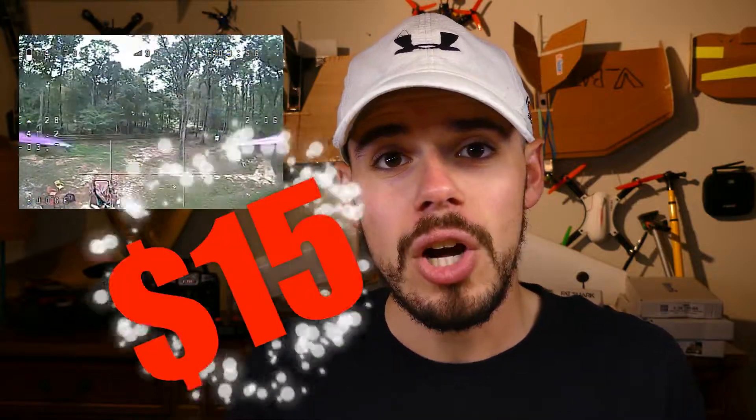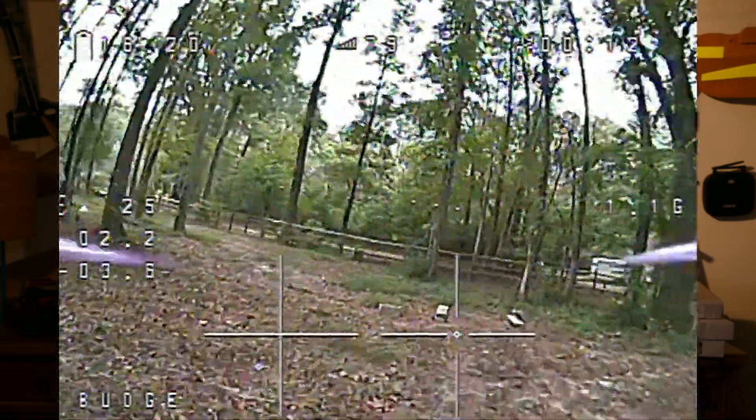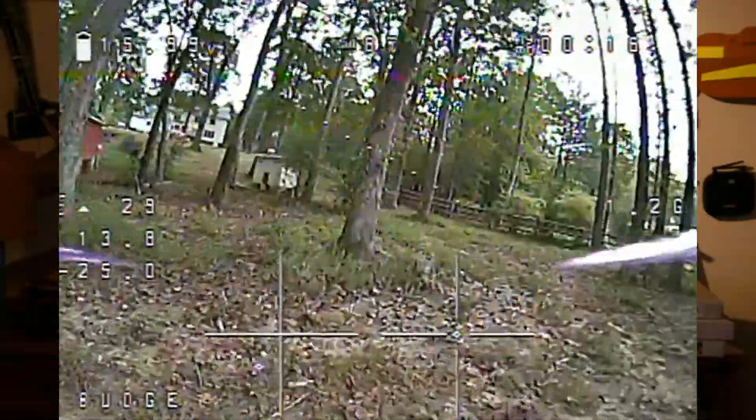It's getting cheaper and easier to do it. In this video I want to cover the air side of things. We'll talk in another video about inexpensive video goggles or monitor screens, but what I want to talk about is how you can add FPV — a camera and a transmitter unit — to your aircraft for as little as $15. For an FPV setup, what you need on your aircraft is a camera so that you can see stuff, and then a video transmitter unit connected to the camera. The video transmitter unit is going to spit out an analog video signal, and on the ground you'll have a receiver that will pick up the signal and then send it to your video screen.